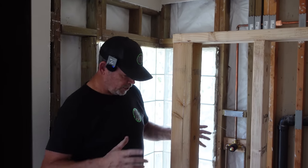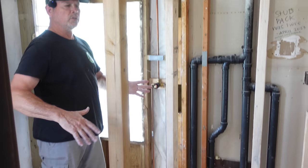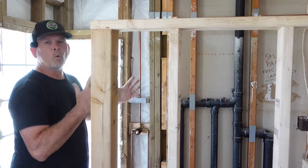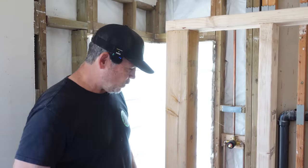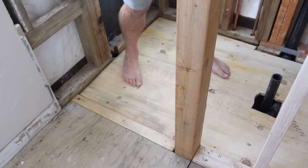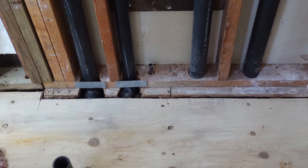Alright team, we're back at the job site. Our next steps are to set this pan from Schluter, put our backer board on our floor and walls, put up our drywall, and start waterproofing everything to get ready for tile. But this is a remodel, so this pan has kind of an odd shape coming out of the door. We've got this little lip we want to accommodate, so we're going to modify that foam pan. Let's grab a utility knife and our multi-tool and get to work.